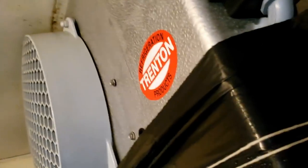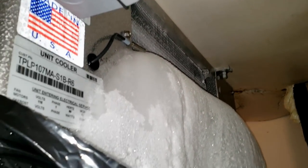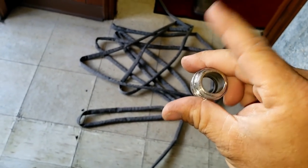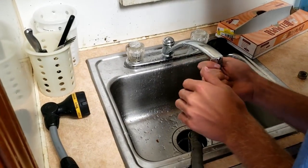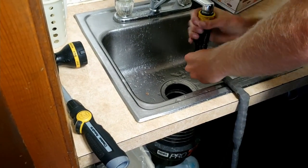We've got a KE2 temp controller with air defrost, and I have not worked with a bunch of these so I'm going to have to go through and double check the programming. As you can see we've got a little bit of a problem here — it's a little iced up — so we've got to melt that. Since it's air defrost, the easiest way to do this is with a hose, so a little adapter here comes in pretty handy — fits right in the regular sink.